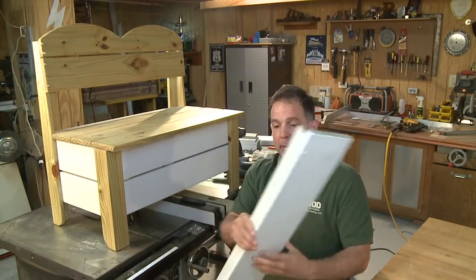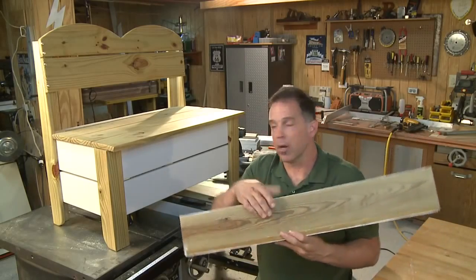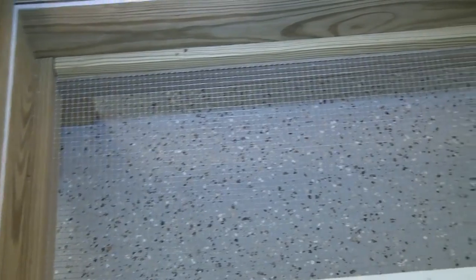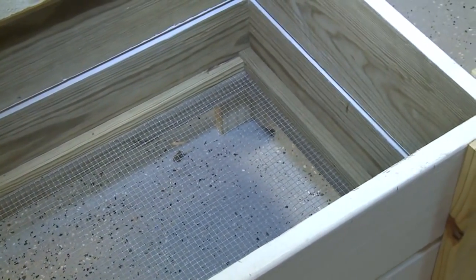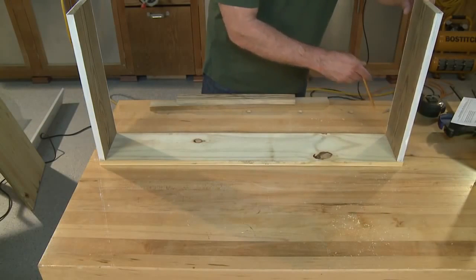Here's one of the pieces we'll be making — gone ahead and primed it. The next thing we'll be doing is attaching a strip along the bottom of all of the lower pieces. This provides an attachment point for the hardware cloth that will line the bottom of the bench, which allows for drainage if we decide to store a hose in there.